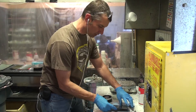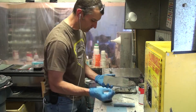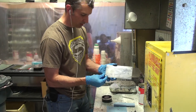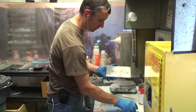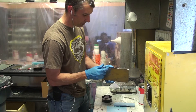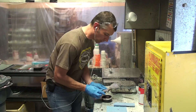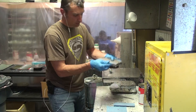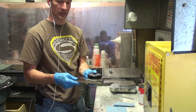We'll take our cliché, put it on our support, and take our screws — this support comes on and off from the machine itself. We'll put the screws in place to secure the cliché onto the assembly, then pop our cup on, being careful that it does not exceed the edge on any of those three sides. Then we can transport this to the machine.